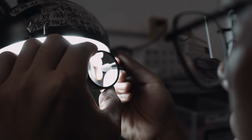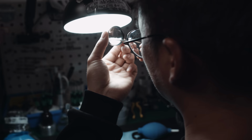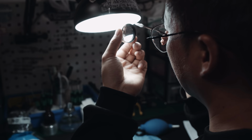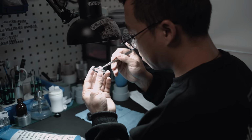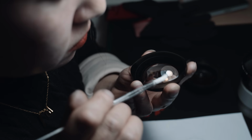Acetone can affect some very old coatings and plastic types, as well as non-anodized paint. Especially the painted in markings can be affected, so one has to know what they're doing and where. It is important to use chemically pure acetone and to work in a well-aired environment. For you at home, IPA is the safer choice.